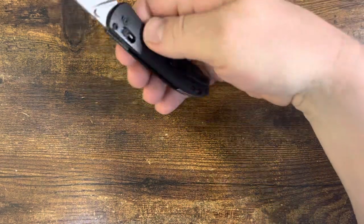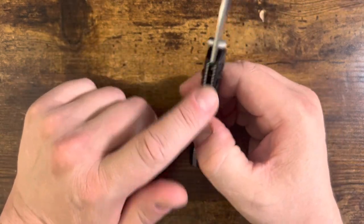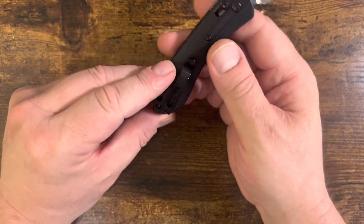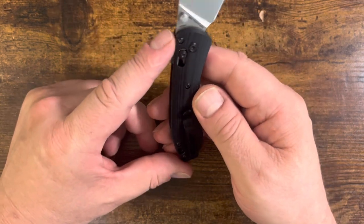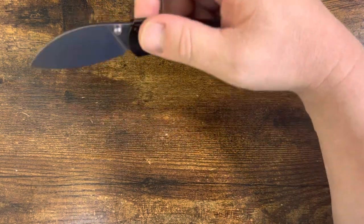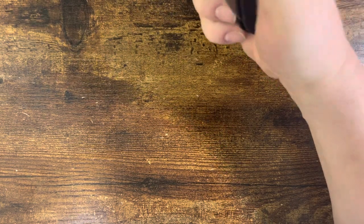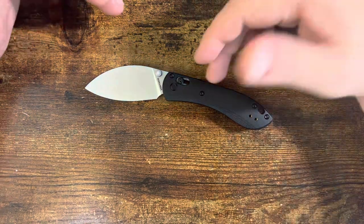It's a good steel for the money. 14C28N gives you a lot of toughness, so you can have a really thin edge — very useful in a blade shape like this. It can give you D2-like edge retention with even better cutting performance. I actually like the aluminum backspacer — it matches the blade well along the spine, giving you good visual tie-ins without silver screws everywhere. This is the kind of knife I can carry in shorts, in a fifth pocket, or in the coin pocket of slacks.